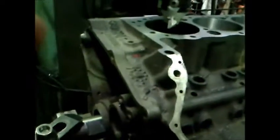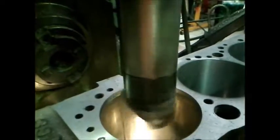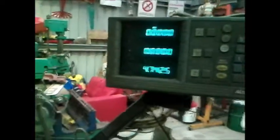So we're good to go. We've zeroed everything, we've centred everything. We'll just bring the table up and as it gets close we'll start running the cut up. There she goes — poke a light in underneath. It's nice and central, you can hear it cutting nice and central. Make sure you get your glasses on because the cast iron goes in your eyes. This is running down — zero's about where the bottom of the bore is. Then I'll shift the block over and do that cut again.